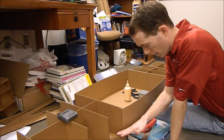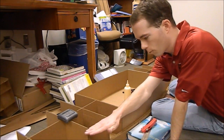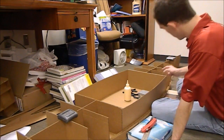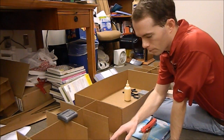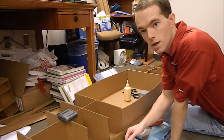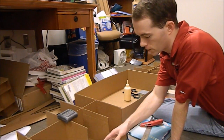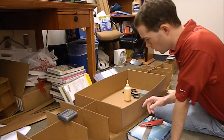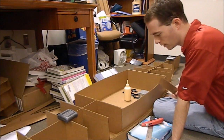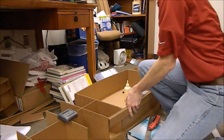I'm gluing in my stringers right now. I've got this one that dried last night. I've got to put one more here at the top edge. I've got to cut out this bulkhead right here and right back here as well, because this stringer is longer than the seam that's going to connect these pieces. I'm going to use this as a glue surface, so that's why I want it to be longer than this bulkhead. I'm going to trace where this cut needs to be, and then I'll glue these up, stacking them up like they're going to be.